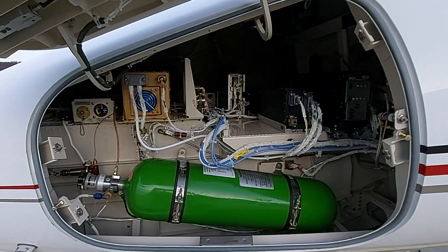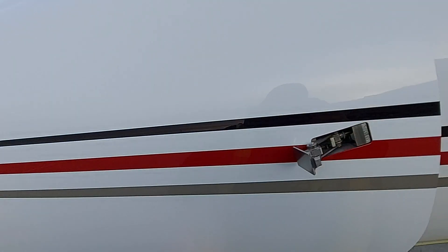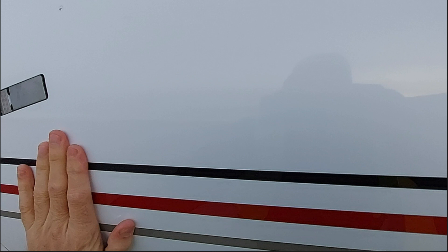Also check if there is nothing loose or leaking in the nose compartment. It is also worthwhile checking the oxygen level here. Your colleague in the cockpit will check the MFD summary page to see the oxygen quantity, but here you double-check — keep in mind the cockpit check is the system check, while this is just the bottle pressure. When you close the panel, make sure you lock it and all locks should be pointed upwards. This is an easy way to know that all the locks on the aircraft are closed.